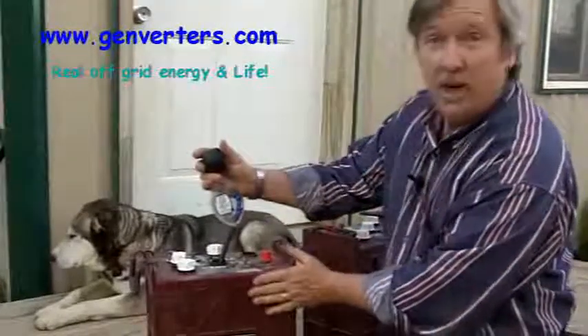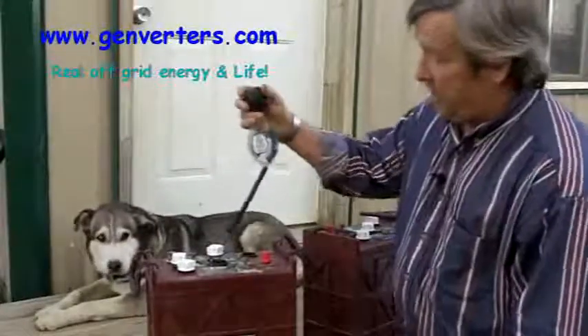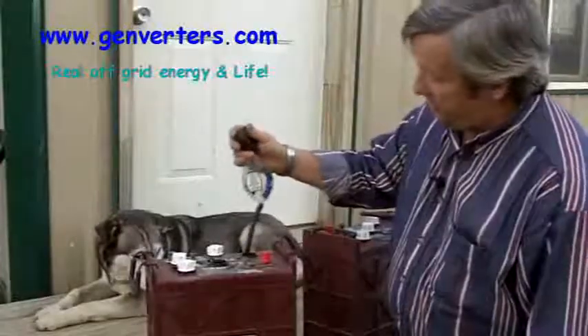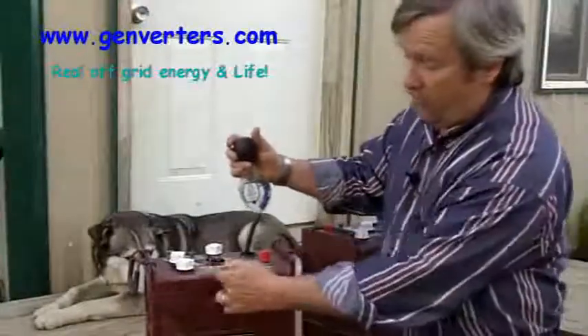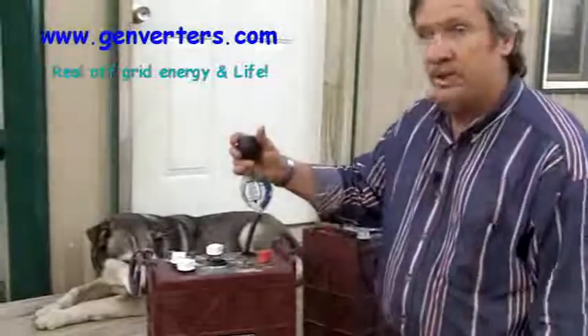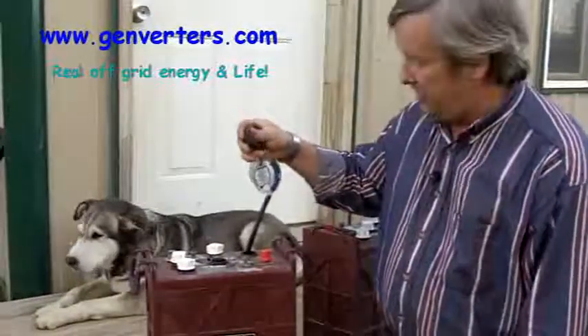It says recharge, but it's fully charged. This is a battery that I've retired. The reason I retired it is this cell — this cell is a completely dead cell. It's 1.0. So I have two volts, four volts, zero volts. My six volt battery is really four volts. It doesn't work at all as far as my 12 volt system that I'm going to need.